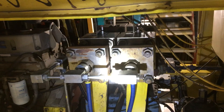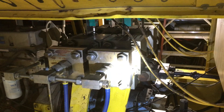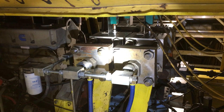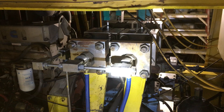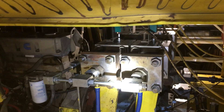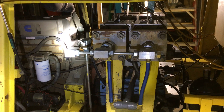This is two double-acting intensifier pumps. This pilot-actuated electronic hydraulic valve shifts a hydraulic piston inside each intensifier back and forth in a reciprocating motion, and that actuates a small plunger with a 12-to-1 area effect that pumps the water. Low-pressure water comes through this blue hose, up through the inlet check valve. The plunger reciprocates back and forth and creates water volume out through the outlet valve. Then high-pressure water is directed out of the manifolds at the end of the intensifiers and into the high-pressure water plumbing.